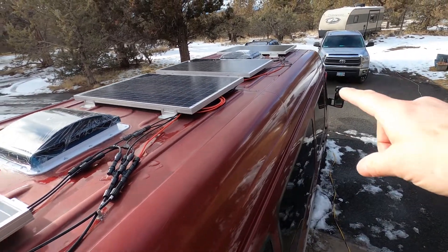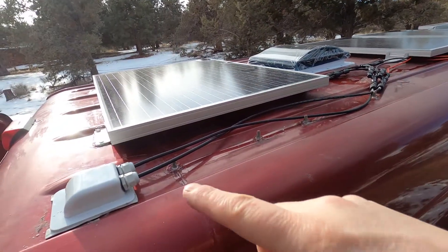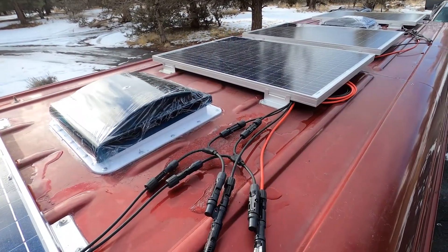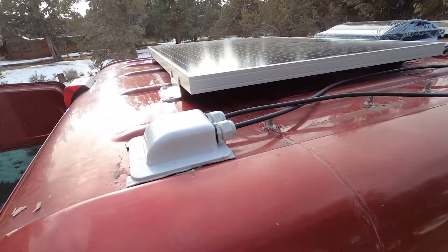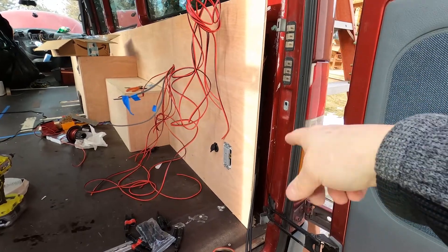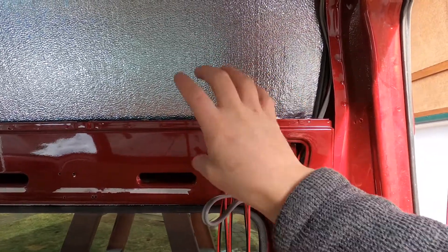Let me show you what I did. I pulled those wires out and connected them up here. All the way down and all the way up — all my negatives are going together, and positives together, so we have 12 volts coming in. As you can see, we're going negative to negative, positive to positive. We can clean a lot of this up and I'll get them sitting on top of that rail so they don't collect any water. They run down through this column and are coming out behind this board. I need to make those wires come out in that hole, pulled that out and it gave me enough room. Much cleaner now — these wires will come through the cabinet right here.